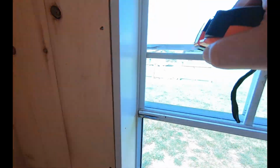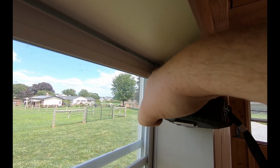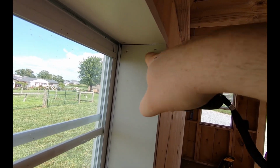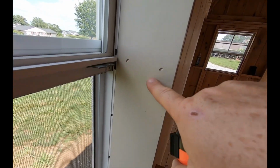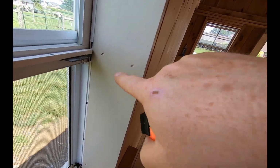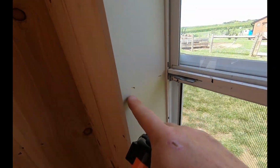Okay, we got our side trim on. Side trim here. Not perfect up in here, but I'm gonna get probably some off-white caulk, and we'll just trim along. We're just caulk here a little bit, fill that in. You could go ahead and caulk these or run some filler over top of these, but again, if this was wood, when you varnish it, they're gonna hide, just be little dark spots. It's gonna blend right in. Or you can hide that with some white caulk or some off-color caulk. No biggie. If you're gonna finish, you would use a finish nailer and probably go ahead and fill the tops.